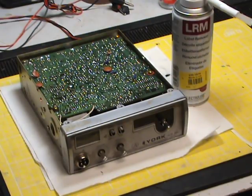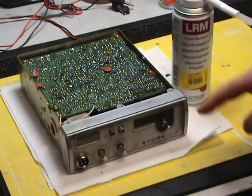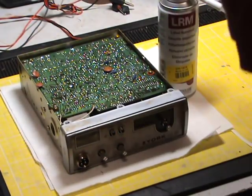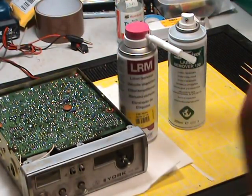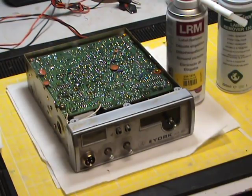On to cleaning the York 861 — we've stuck the cases and knobs in the company dishwasher. We were going to put the front panel in, but unfortunately the microphone socket is captive and we're not going to remove the microphone socket and its earthing ring just for this. So Mr. Chippy is going to clean the front panel by hand. The top left and top right were all nasty and sticky. The first thing we've done is use a label remover — we use the Servisol one and the Electrolube LRM one from RS Components, which has a built-in brush. The Servisol one may be available on eBay.